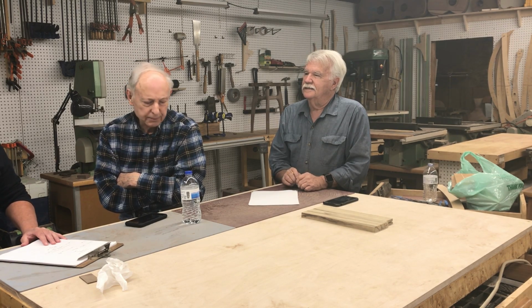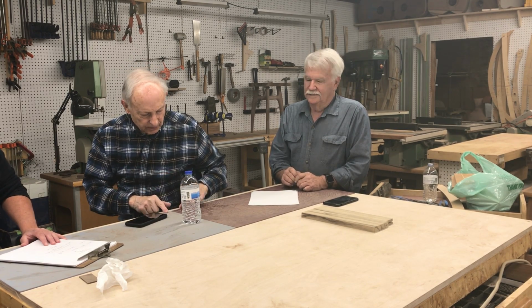When you said there's a lot of moisture, are you talking about the glue? Yes, glue has about 50% water in it. You want to let that water absorb into the wood and dissipate or evaporate, and let the little microscopic balls in the glue bond together. They recommend 24 hours, by the way, for curing. No stress on it after 24 hours.